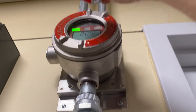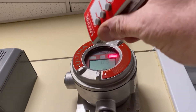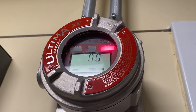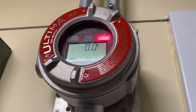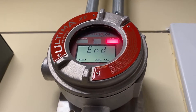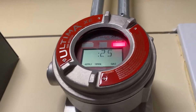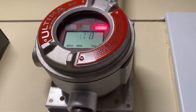It didn't register, so we'll do it again. It's going to calibrate and then it counts down. Once it starts counting down, you can release all the buttons. So it's telling you it's doing an iCal. Now this is where you would apply a span gas, but with the oxygen recalibration, you don't need to apply a span gas. The span gas is assuming that you are at 20.8.